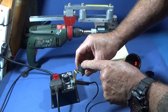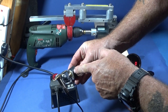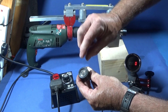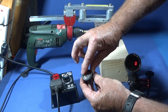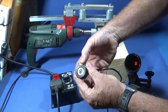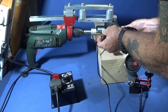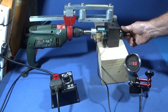This is a piece of Delrin bar — I've drilled and tapped it for six millimeter and put a grub screw down part way, then secured the bracket with a six millimeter nut, drilled it up through from the underside and bored it out for this rare earth magnet — it's a thin one. I've screwed that in with a self-tapper screw. The magnet is just below the surface of the Delrin — you don't want the magnet touching metal because when it snatches on they're very brittle and they can actually break. This one goes on to the tool post and I'm about five millimeters from that rare earth magnet.